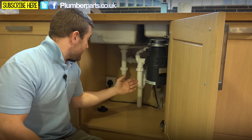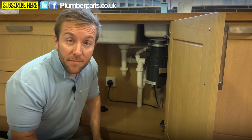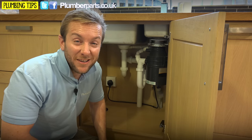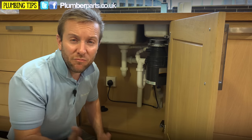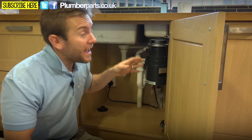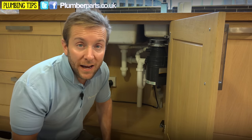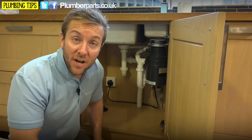The first thing you want to do is turn the hot and cold water supply off to your sink. On this one, our hot and cold are just at the back — they go onto flexibles, which contrary to popular plumber parts parlance, I actually agree are a must nowadays under a sink. Doing it in hard pipe, getting up behind the sinks with your grips and everything, is a right nightmare. If you haven't got valves there, you'll have to go to your hot tank, combi boiler, or where the mains comes in.